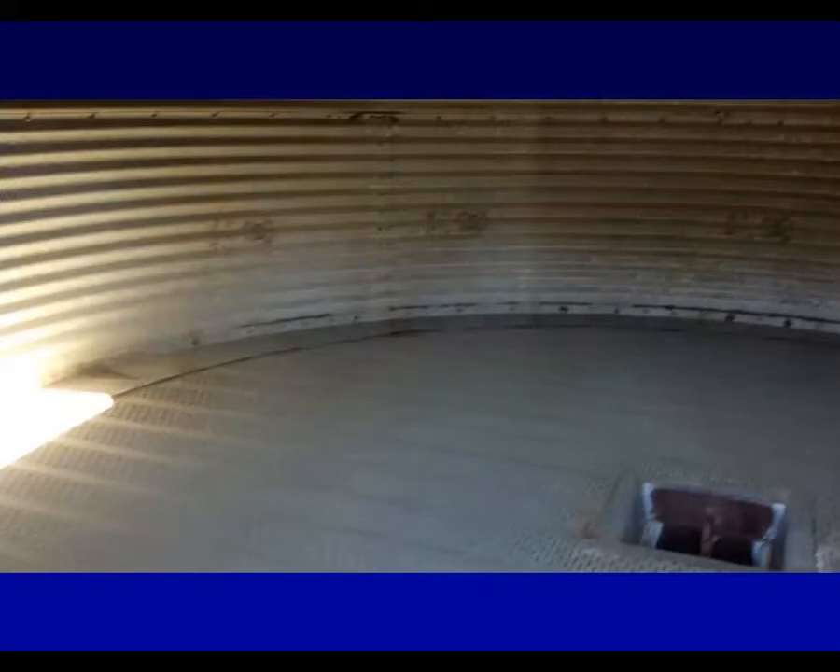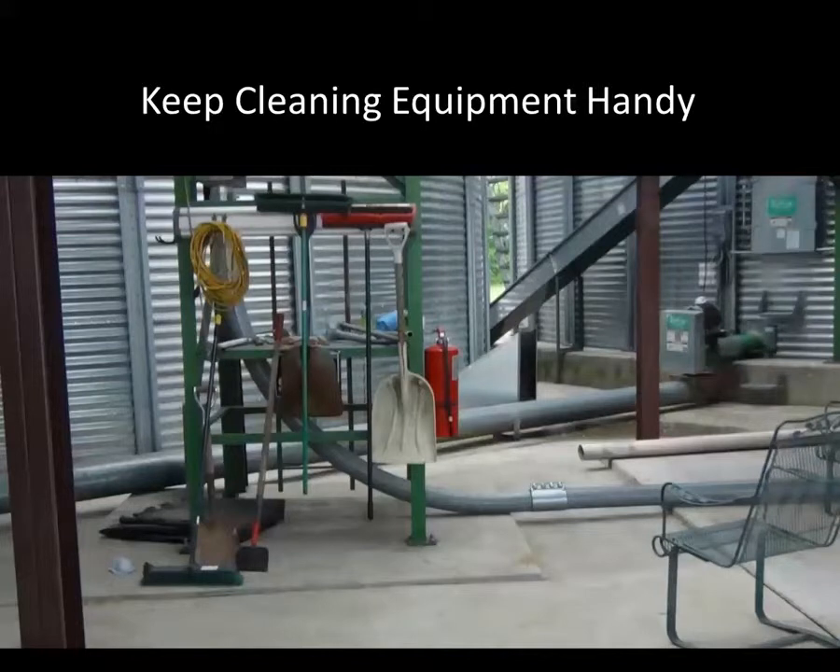It's important to get your grain bins cleaned out — easier said than done with corrugated floors and the holes needed for aeration. But every bit of cleaning you do is going to pay off later. The most important thing is to get all old grain out and not let insects build up while the bin is empty. Clean it right out as soon as the previous batch of grain is sent out. Keep your grain equipment clean, because the cleaner the whole facility is, the less harbor there is for insects.